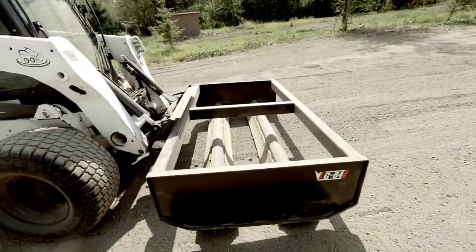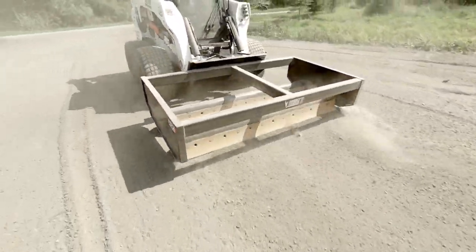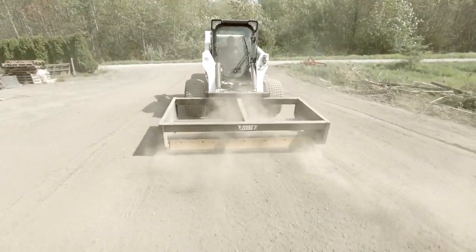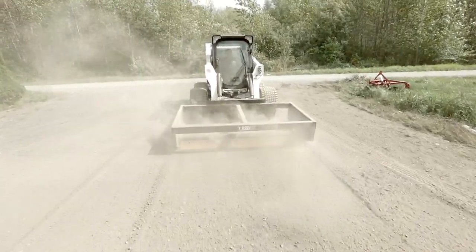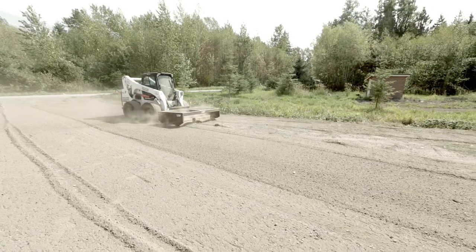Because there are parallel blades facing forward and reverse, this allows you to grade both in a forward direction and a rearward direction. One of the favorite applications is to grade a road off and actually tip it onto the nose of the front blade and go in reverse — it actually looks like you've rolled it with a professional roller.